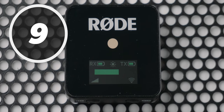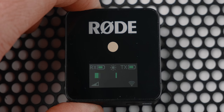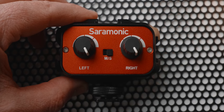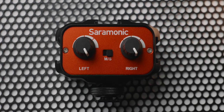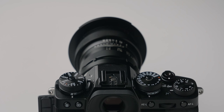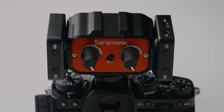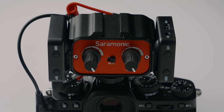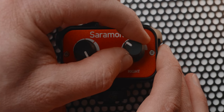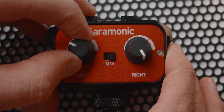The Wireless Go has three output levels that can be adjusted on the receiver. This is fine for a set-it-and-forget-it method, but sometimes you need more control. You can use the camera's audio menu while filming, but this is often very cumbersome or not possible. Using a $40 mini mixer allows you to turn the microphones down easily with a knob, and it can also handle two microphones. Simply mount the mixer to the top of your camera and connect it to the mic input, then mount one or more Wireless Go receivers — easy because it has built-in cold shoes. Connect them to the mixer and set them to the loudest mode. Now you can independently adjust the wireless microphones using the two knobs on the mixer, making small changes to audio levels rather than relying on the three modes on the Wireless Go.